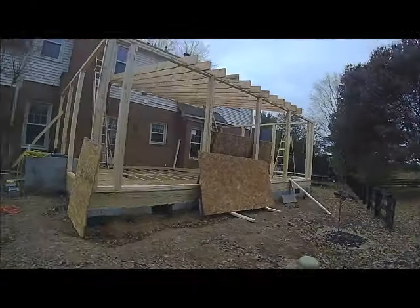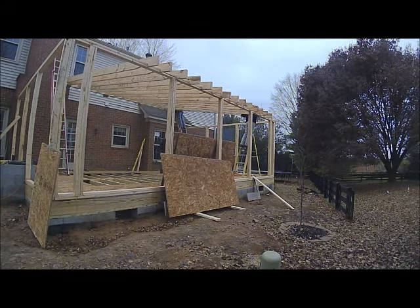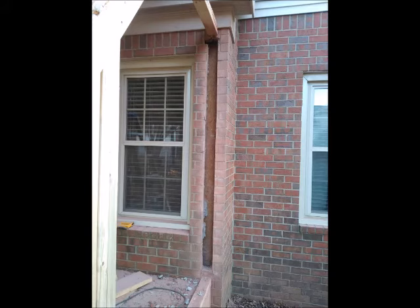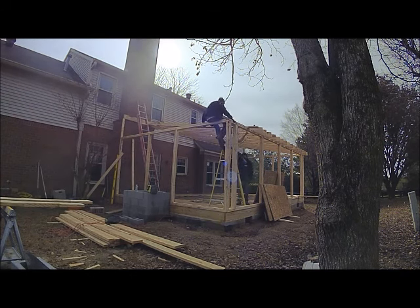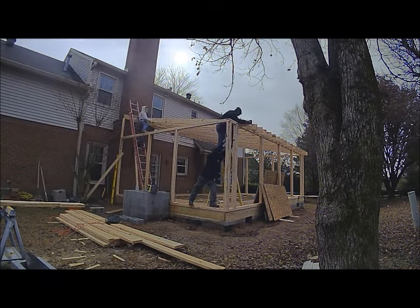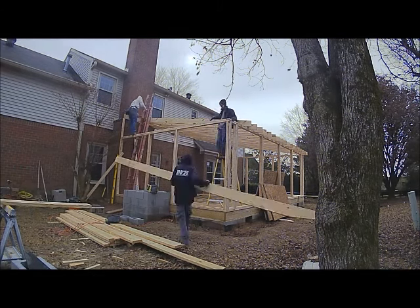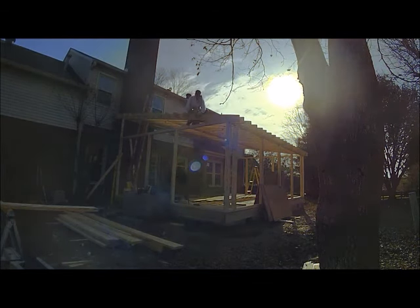Getting the last wall up. Anywhere the wall ties into the house, you have to have it properly done. We had to cut the brick out, hit the studs of the existing house, build that out with two-by-fours, and tie it into our wall — it has to be tied into the structure of the home. Same thing with the roof: there's one long ledger board at the top of every rafter. The siding is cut away right there — it's a two-by-ten that nails into all the studs of the house and locks the roof in. It has to be bolted as well, with lag bolts or construction screws.